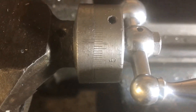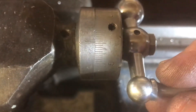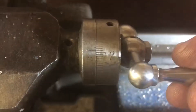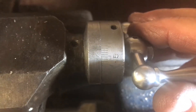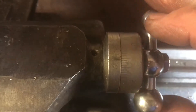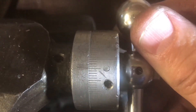Just a tip about adjusting these dials: there's quite a bit of slack in this. Moving it even a small amount — that's 0.2 of a millimetre or more — it doesn't do anything; it's got a bit of slop in it. So when you want to adjust it against the surface, you wind it out a little bit to take up the slack and wind it in until it reads zero.